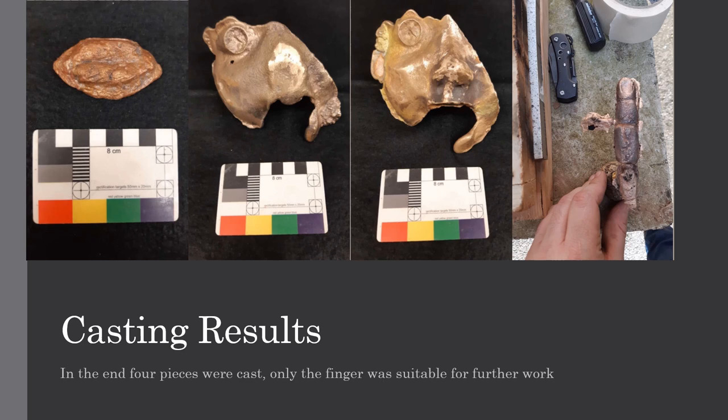After the issues with copper casting, I decided to skip trying to cast a nipple in copper and instead moved on to bronze. The first attempt at the face ended up in failure as the amount of metal placed in the furnace was not enough, so the nose did not fill up. The second time around, the nose formed almost perfectly — only some light work with a rasp was needed to clean it — but the jaw did not form. I believe this is due to the angle that the model of the face had to sit in the mold; the jaw was higher than other areas and the metal flowed into the lower areas and the nose before it reached the jaw.